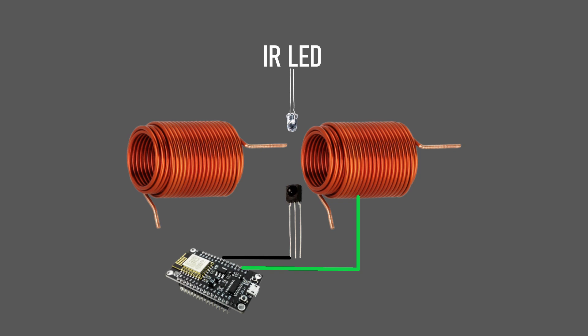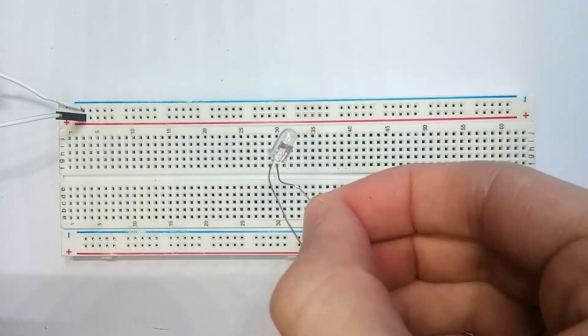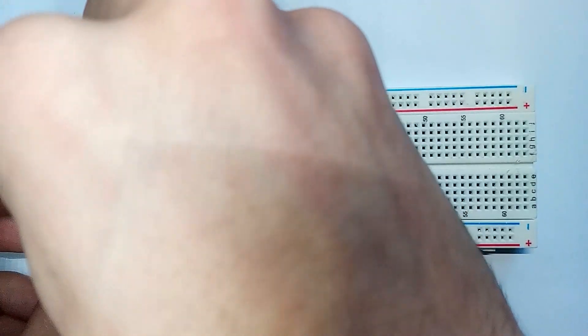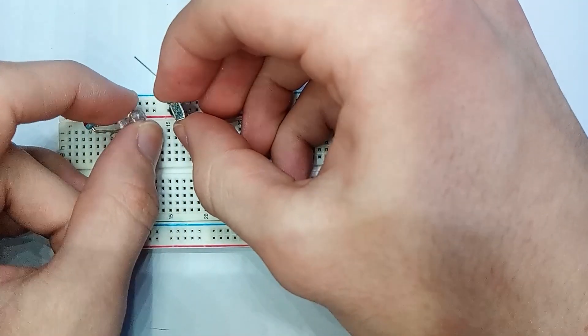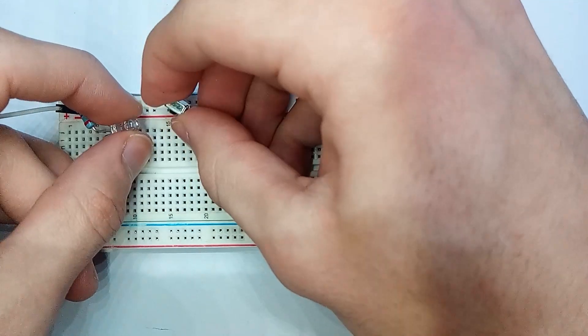The optical sensor isn't perfect though — you really have to place it in the perfect position to have the coil pull the projectile in the most efficient way. It's slightly more complicated than it first appears. I have an infrared IR LED that emits IR light when powered, and we detect this with an IR receiver. This specific receiver was not the best fit for this project, as it was made to detect IR signals from remote controls. For my test setup, I have an IR LED connected to power through a resistor and a phototransistor hooked up to power, with a signal pin to measure the output.